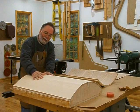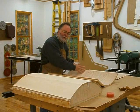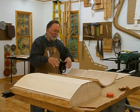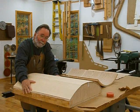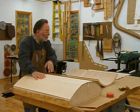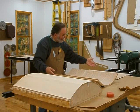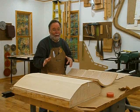So now what I'm doing is I'm laying this maple veneer out flat, then I'll apply the glue to the inside, then I'll place the substrate right on there. Because the substrate is basically forming the maple around the form, I think I'll have a better glue joint. And then I'll apply glue to the outside, the show face of the substrate, and then I'll apply the curly maple veneer, and then all that will go into the vacuum bag.